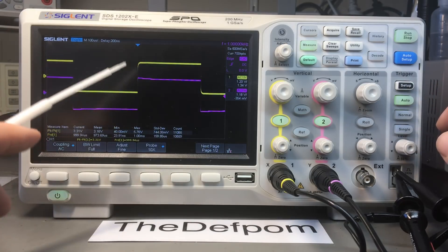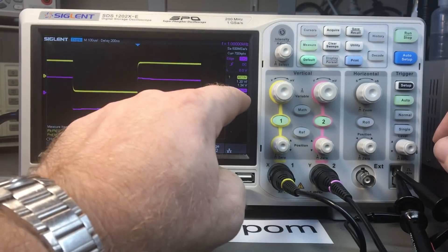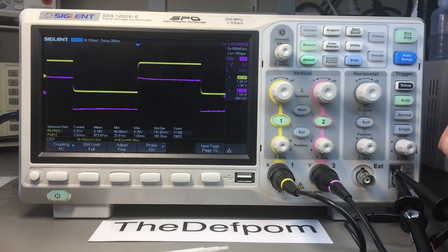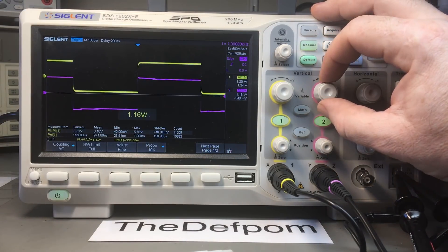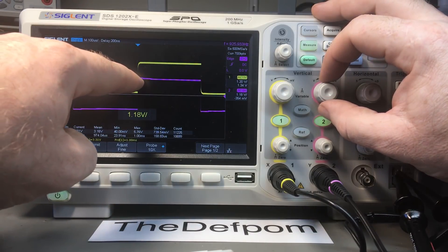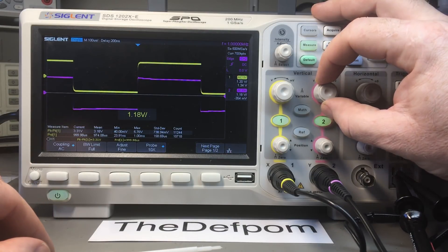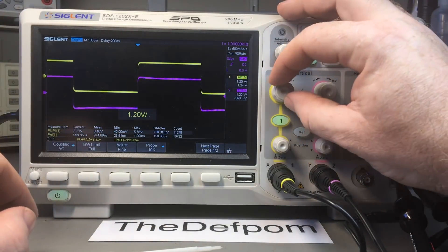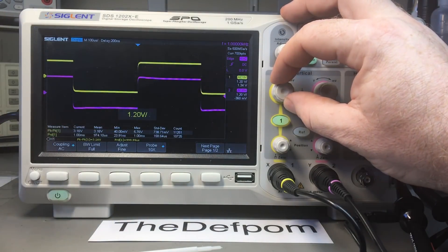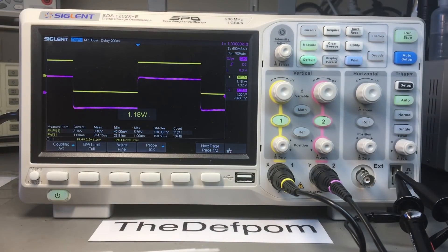So that's what you have to look for if this issue is present: when the changing range is between 1.18 volts and 1.2 volts on the probe compensation port, then you have an issue. It could look like it goes up, or it could look like it goes down - it could be either way around. So if it's changing on those ranges, that's the issue. Now I'm going to recalibrate this and show you it can be done okay.